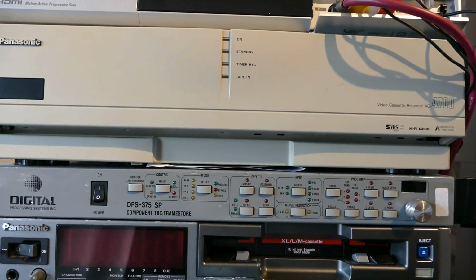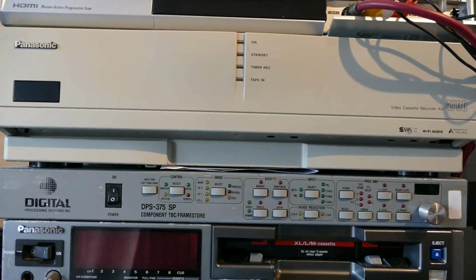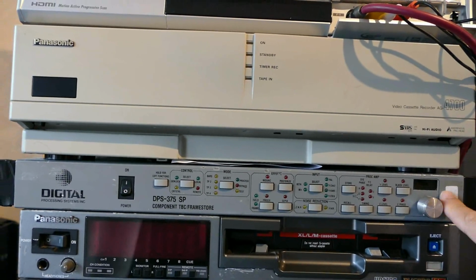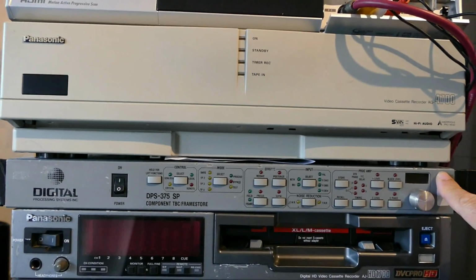But it also takes the RF output feed, that's to say the output from the heads, from the video recorder, and applies its own digital dropout compensator when it sees the RF output falling low. So it gives absolutely super results. That is the holy grail, really, I think, of getting the very best out of U-matic.